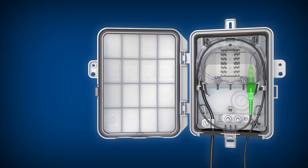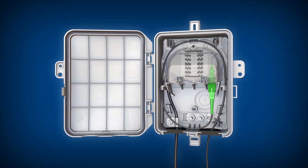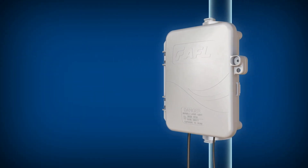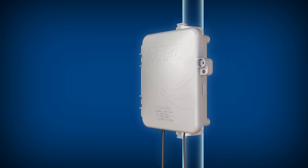The base also features mounting tabs that permit mounting without drilling holes in the box, which could become leak paths. The mounting tabs can also be banded to utility poles or clamped to small metal pipes or ground stakes in situations where mounting directly to a structure is not permitted.